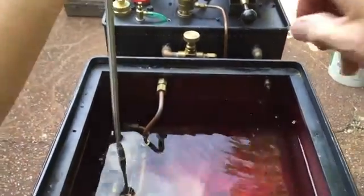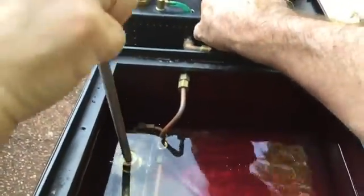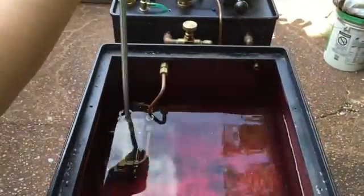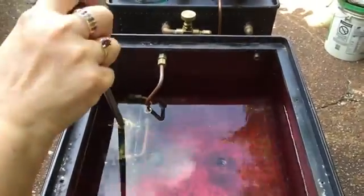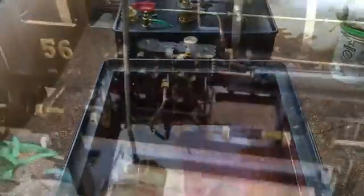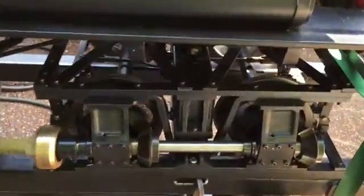So now I'm going to close the bypass line up here and then the water will go into the boiler. You can see she's still pumping and it's quit coming out the return line into the tender, so now the water's going into the boiler.